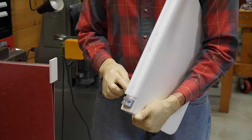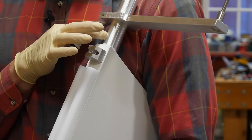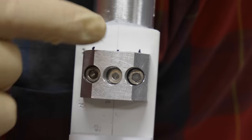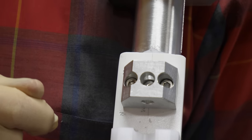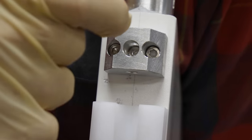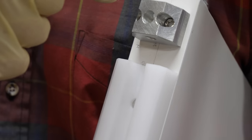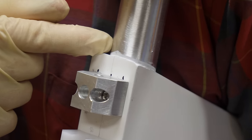The machining is basically done. Another thing to keep in mind is when I attached this rudder to this pipe, these holes have been drilled as well as tapped. Because when you try to drill into the round edge of a pipe, the drill bit will tend to walk. The trick is to drill and tap the center of each of the two fittings and then mount them, lock them in position, and then use these holes as drill guides to help keep the drill lined up as you're drilling into the side of the material.